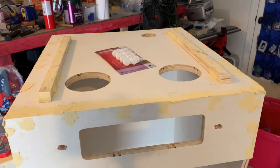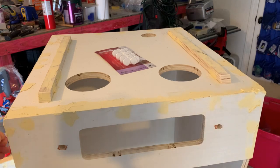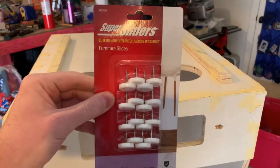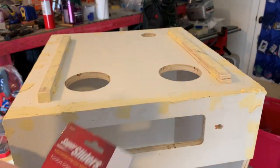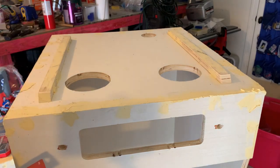I should add that I'm using MJR's guide on how to build a virtual pinball cab - obviously it's the same cab because he modeled it off a WPC style machine like Doctor Who or whatever. When I get this flipped over I've got these furniture sliders - I'm going to put some on, three inches down, three inches up, and then in the middle. Regular cabs have these just so you're not riding on the wood.